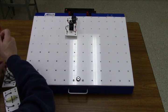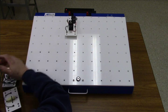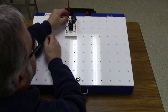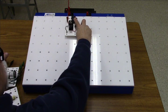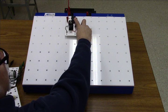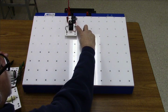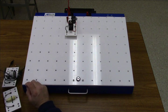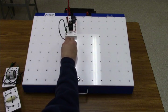We will take our power source in to the top of board A. By going in at the top of board A, we're assuring that we are protected because board A has a fuse at the top. We will almost never use the 3 o'clock position over to the right here, and our circuits are then going to be wired out of the bottom of board A.